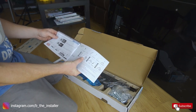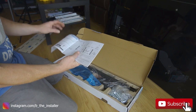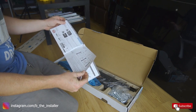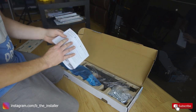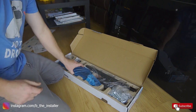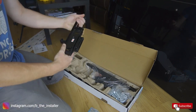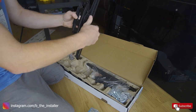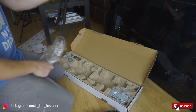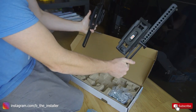The instructions say to use a 7/32-inch wood drill bit, but I just use a one-quarter inch. When it comes to concrete, I'll do a separate video on that since this isn't the most efficient method for concrete. Now let's unbox. It has two wall brackets — they have an arrow for up, and you keep the knob to the outside of the TV. So the right bracket and left bracket are labeled: arrows go up, knobs go out. That's how you know it's correct.